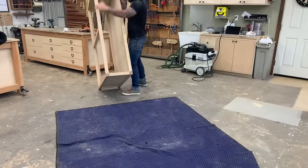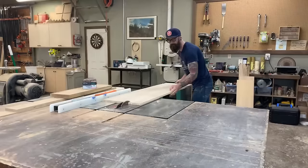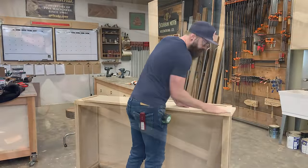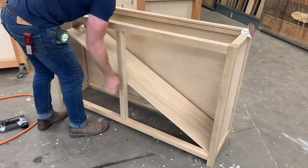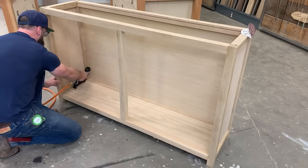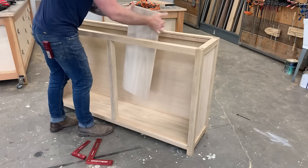With the supporting strips glued on I flip the cabinet back over and there's a nice recessed shelf where the bottom plate sits. I cut down a piece of three-quarter-inch oak ply, sanding the edges slightly so it doesn't chip out when pushed in place. I add a little glue onto that recessed shelf, pop the plate in, and use a 23-gauge pin nailer to hold it while the glue dries — you won't see the pins when it's all said and done.